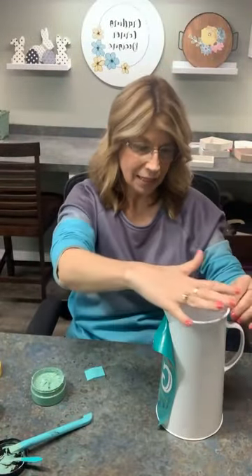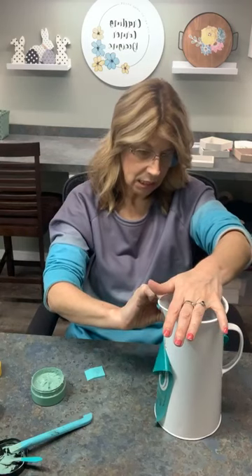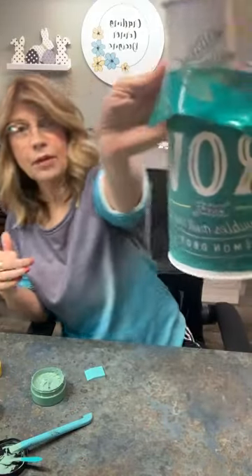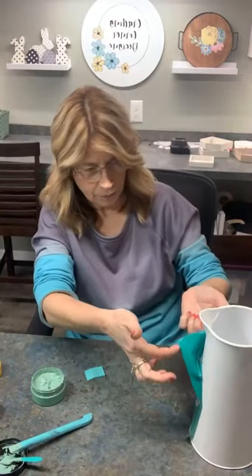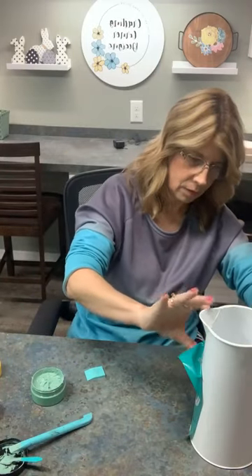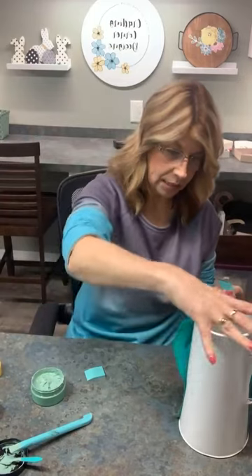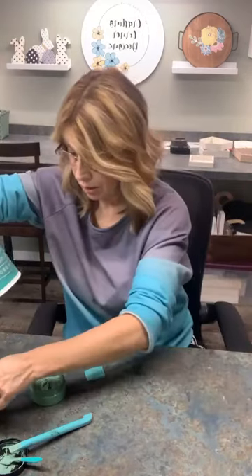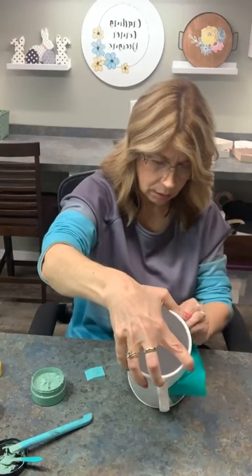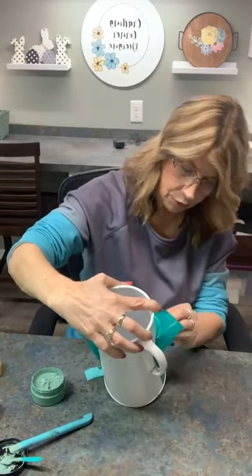If I peel it too much then I can't work up here, so I can just lift it a little bit. If you're working on a board it's really easy to just pull that right down. I actually did a video on that — I'll just call it 'lift and peel.' You can lift your stencil all the way down to the bottom and then lay it kind of back down so that your stencil's not sitting on there, because when it starts drying your stencil is going to take the paste with it.